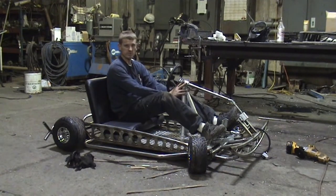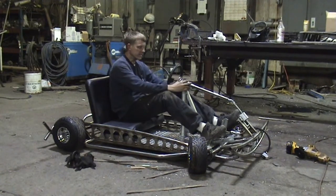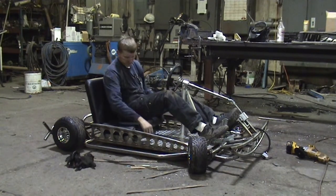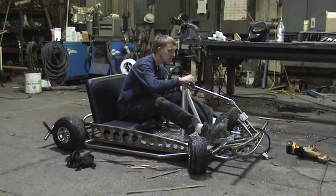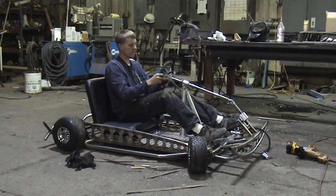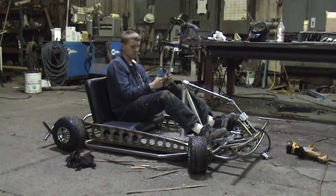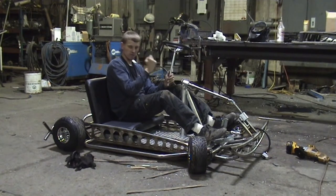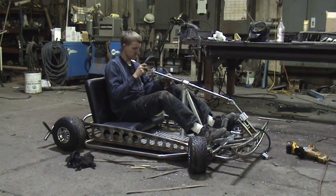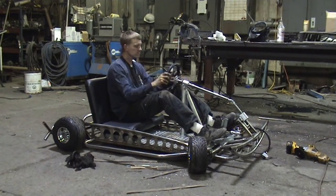Center column houses the bearing that allows the shaft to turn. And then inside of this shaft is a keyed barrel. And what happens is, let me put this in here, the steering wheel is attached to another shaft with a keyway in it. And inside of there, if you saw in the welding, I welded a little tiny key in the end of here. And that keys the shaft to the steering wheel, but this is just free to go, and that's that phenolic bearing.